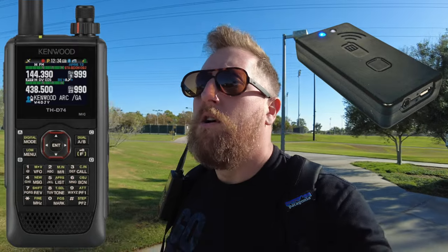That's pretty cool. When you're out portable like this, you've got two options basically. You've got a TNC using packet radio, or you can use Vara FM, which is gonna require basically a sound card interface to a radio and some way to key it. I'm taking the very easy approach and I'm gonna be using this Kenwood D74. Now, we're gonna explain some other options too, because getting one of these right now is borderline impossible, with prices for used going upwards of $800. Not really feasible. But I'm going to demonstrate that with this today, and then we'll talk about some other options,